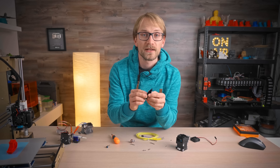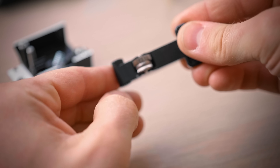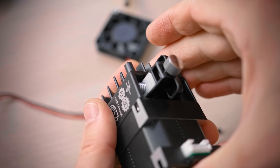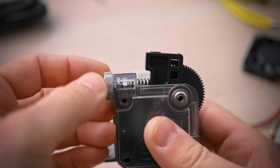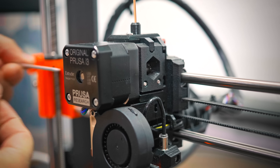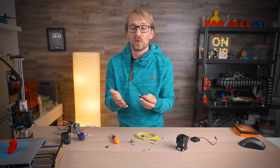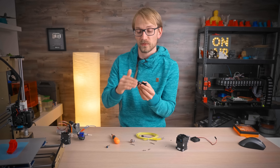Next, the tension adjustment. They've got a really cool injection-molded idler lever, and you can tell E3D have learned a lot about injection molding since their first attempts with that V6 fan shroud. It's got a slidey ramp setup that, as you tighten the screw up top, pushes out a white bit to the side and increases tension on the idler spring. The mechanism works well, but there is no indicator of how tight you want to set it. The Titan had a little peephole that showed how much tension you're putting on the filament. On other extruders — like the MK3S — you at least see the point where a screw is flush with something and that gives you a reference, but here it's just this white bit maybe being flush with the black bit at some point, or you can count turns from the screw bottoming out. There's no easy way to tell what level of tension you're at.